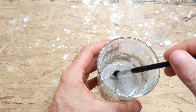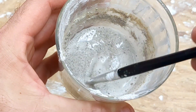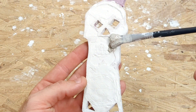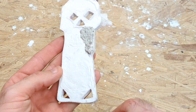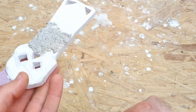Because I'm using copper, I need to add an additional coating. This is the same plaster but with sand added into the mix. This additional layer gives it a harder shell, which I believe is very important when using lost foam casting in copper, brass, or any heavy metal.